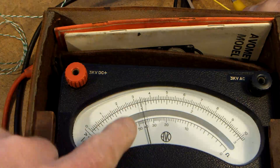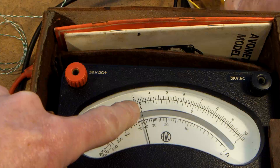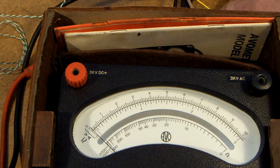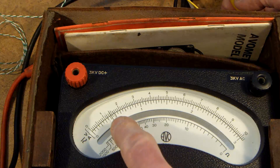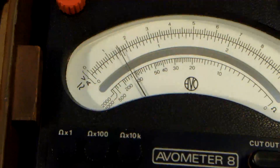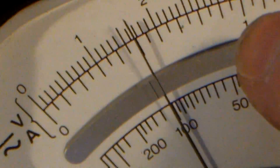I'm going to call a halt to this now, because this is the voltage across the cell and that's just at one volt. I've switched it back on again and watched it discharge to one volt. Now I'm actually going to short out the cell — I'm shorting out the meter terminals on the cell. That's shorted out. When I take the short circuit off, this is 0.4 of a volt and you can see it's climbing.